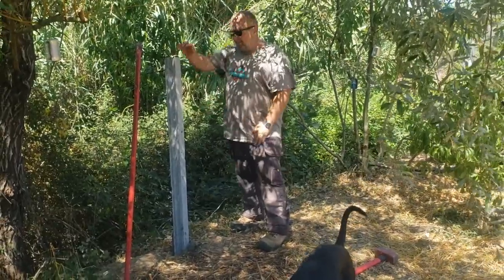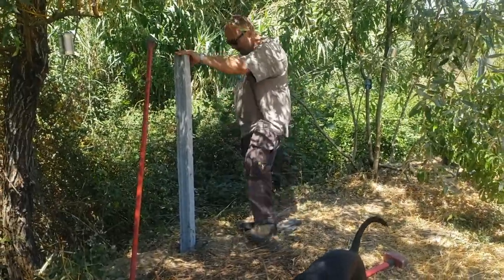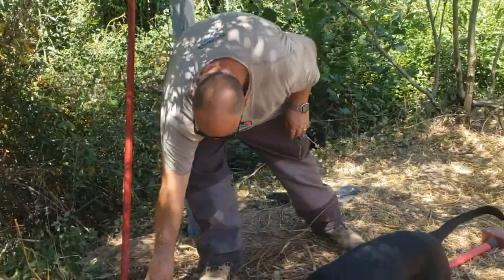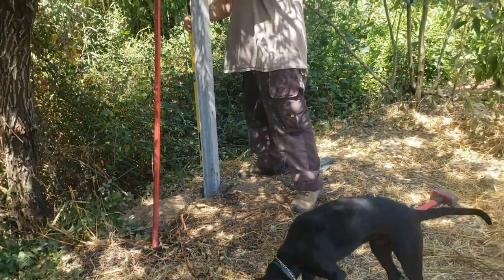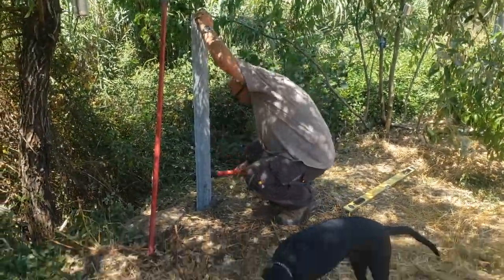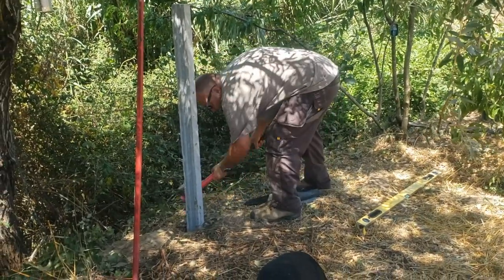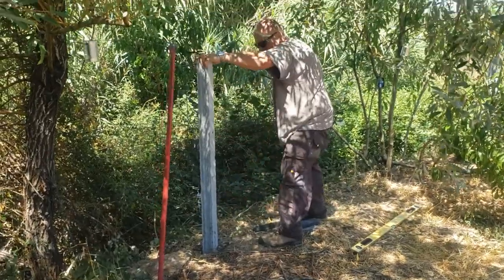Let's give you an example with this particular hole — the soil is a lot looser, so there's a little bit of backward and forward movement. What I've done on this one is wedged the back and the front. Just check the level. I'm just going to start by using the sledgehammer to chalk that in at the back and the front like that — there's the back and the front sorted.